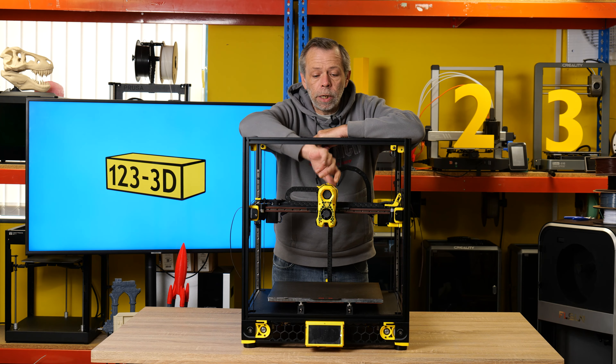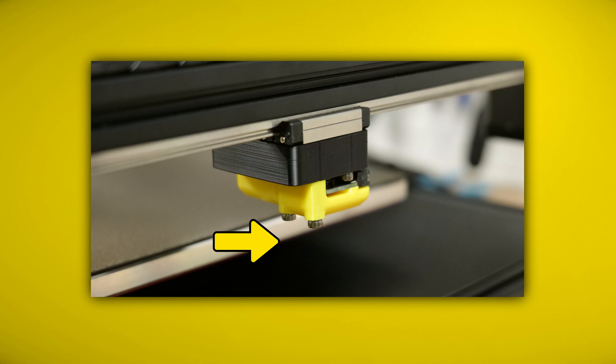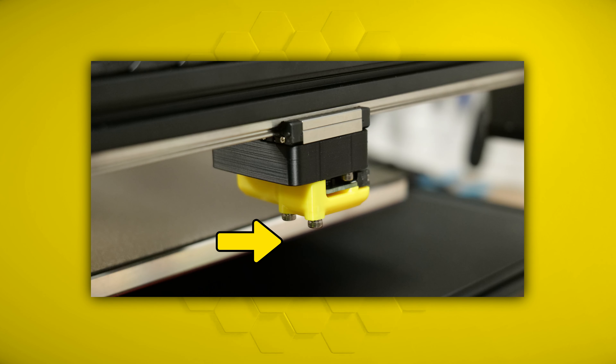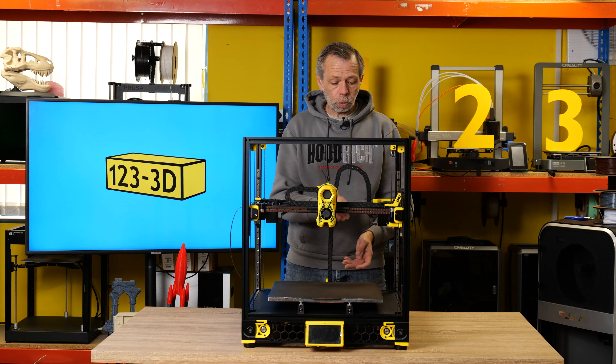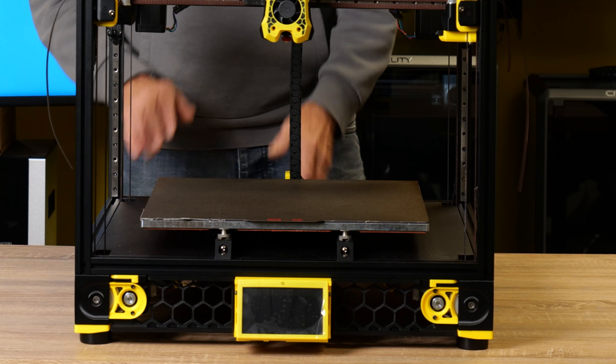I have the limit switches attached to the bottom of the gantry, which plug in. We have a little board that plugs in. The cable then routes around the back of the print — there's a nice little channel in the print where the cable routes up and then follows the same path through the cable chain down below. The two rear stepper motors I routed inside the channel and then used the plastic cover strip that LDO provides in the kit to secure them neatly out of the way. They all run through the larger cable chain at the back, straight down to the base of the machine.